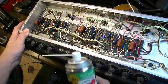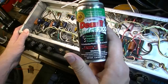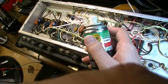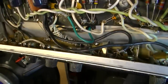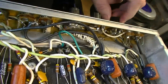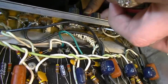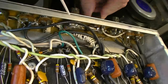I mean, really the best stuff for pots is this stuff, DeoxIT Fader, F100. I'll put a link down in the description if you want to get some of this stuff. It comes in a really tiny can and it's expensive as hell, but you don't use very much. It doesn't even let you spray very much when you apply it. Here, I'll try to show you what I mean. Just a little spritz down in each one of these. Work them back and forth. And it will basically lubricate these as well as clean. And that protection will last a long time.